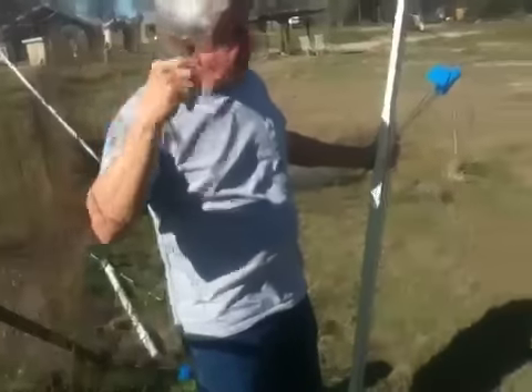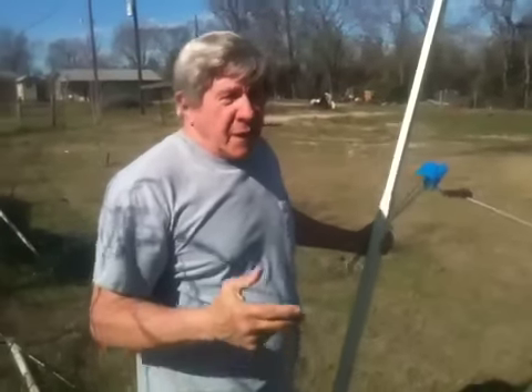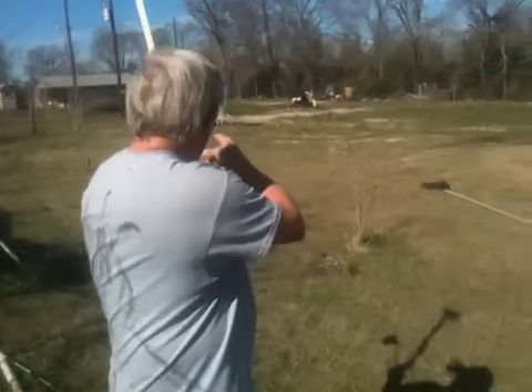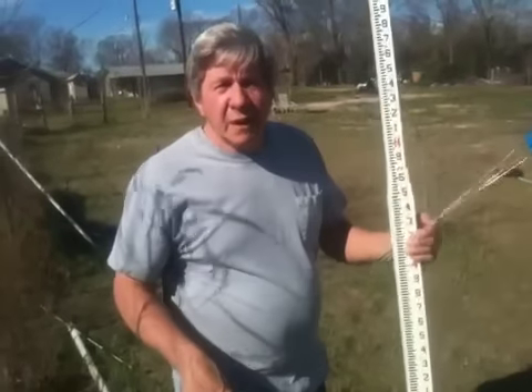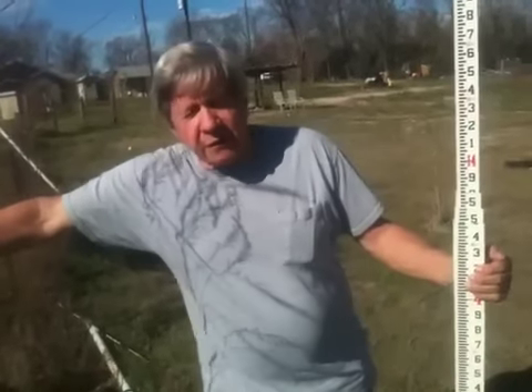It's quick — doesn't take very long. Depending on your slope. This slope here is probably 100 feet and we've dropped 2 feet. That's a 2% slope — I'll get almost no erosion off of that. It's a first-class kind of contour, a first-class kind of terrace. And you'll want to keep yours under 3%.